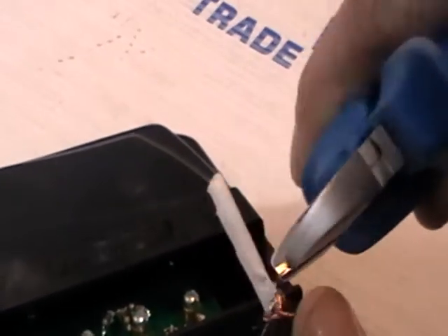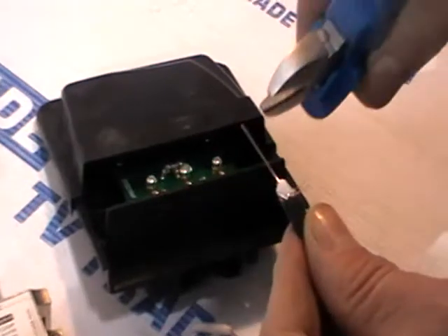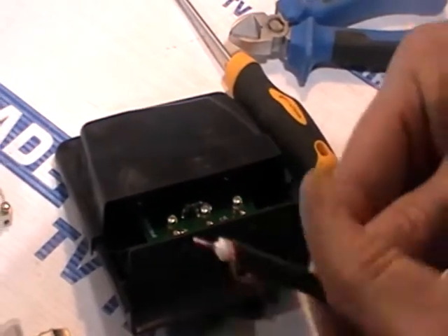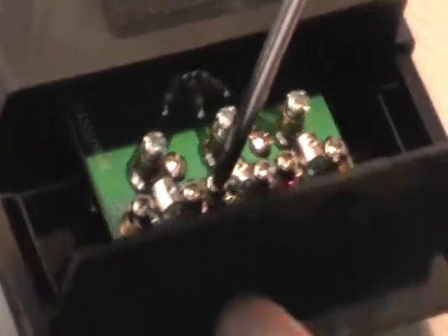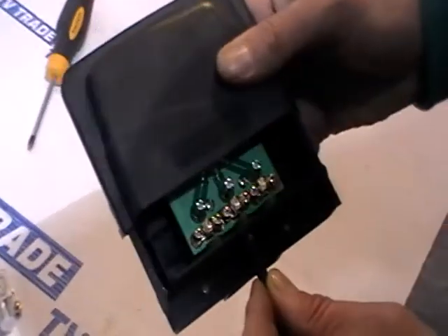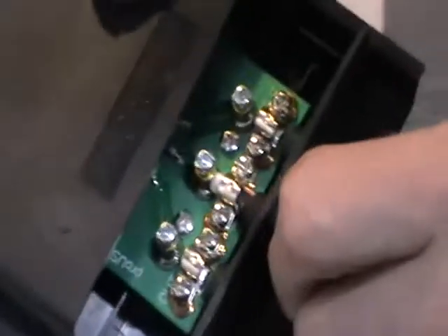What I do is simply cut off the excess white and twist it so a certain amount is exposed. I then come along, get this copper and wrap it around the edge like that. I get my screwdriver and loosen off these nuts. This is the cable coming from the aerial so it will be fed into the centre. We simply push it through this hole on the bottom, which is watertight up to this point — punching through that light rubber hole and pushing it in.